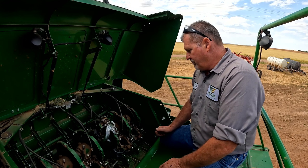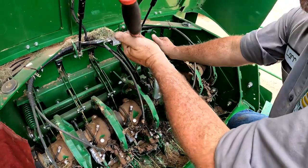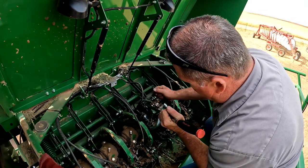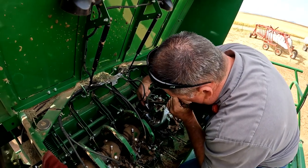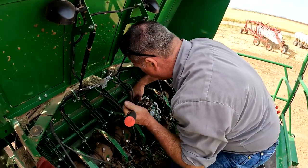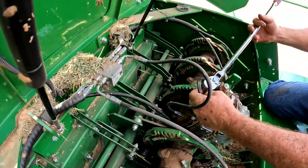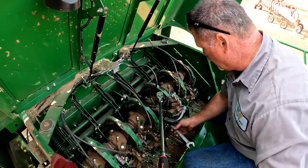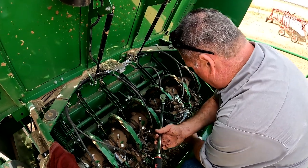What we've got here on this wiper plate is a bolt that runs through the knotter bracket that this wiper arm pivots on. We basically have to get an Allen socket into that Allen bolt — which is a little tricky to do with these grease lines in the way — hold it there, and then hold the bottom side with a 24-millimeter wrench and try to break that loose. I'll show you something else that's pretty important about this in a few minutes.